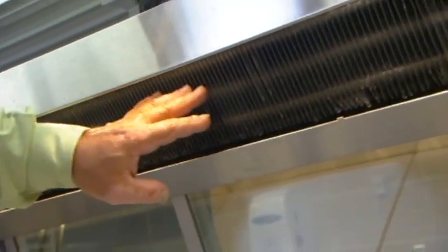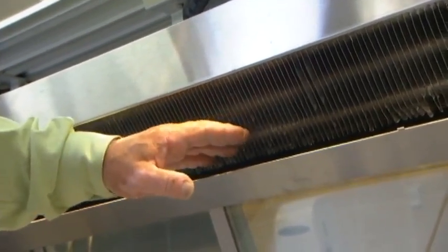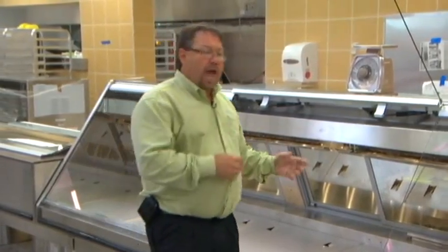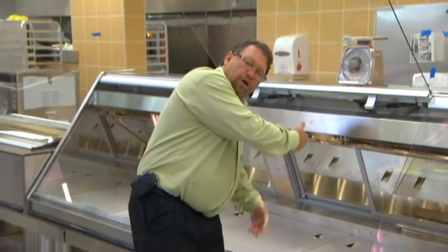This gravity coil is there to help temper the air as it comes in and to keep the air on top of the product cooled. We're just tempering the air a little bit — we don't really want to do any refrigeration. It also helps keep a natural circulation; as we cool the air, the cooler air falls and the warm air comes up into the gravity case.